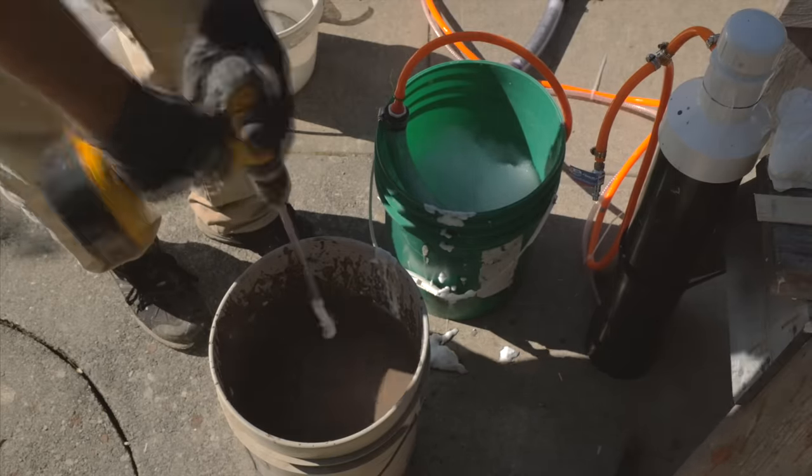I don't see any cracks or warping of these panels, so I think the bigger ratio of Portland to foam was the answer. It appears if you want strength and durability improvements, you really need more cement. If that changes over time, I'll update my blog post. At this point, I don't see a huge advantage to adding perlite to aircrete or to doubling up the wire grid, but it doesn't seem to hurt either, so maybe the takeaway is that it's easy to add both if wanted. The liquid cement dyes worked well and it was easy to add — next time I'll even add more to get deeper colors. Darwin's FoamMate worked very well. It allowed me to quickly make foam just when I needed it, and just as much as I needed, so I can certainly recommend that.